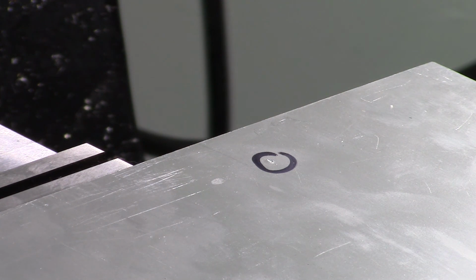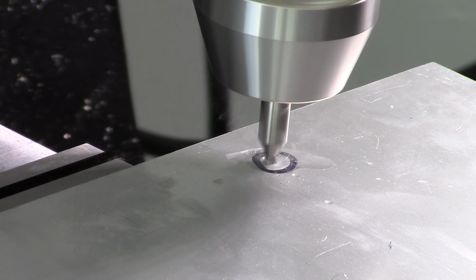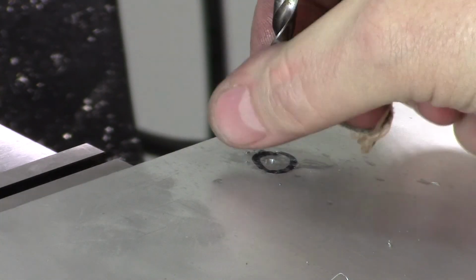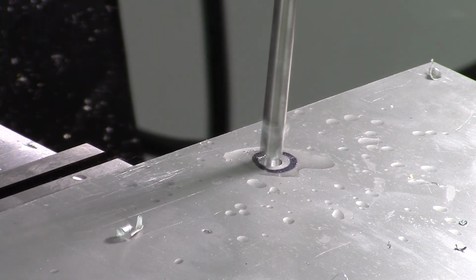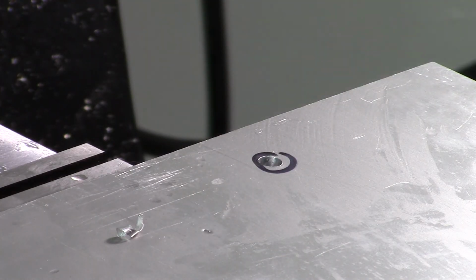You get a 1/4 inch drill. Okay, get a little WD-40 here. Looks good on aluminum. Let's see, we are aluminum. Run it fast. So yeah, we're running about 2,200 RPM, which is about half of calculated speed. That's plenty fast though. About as easy as it gets. Not much excitement to drilling holes. The only thing was the getting it aligned.